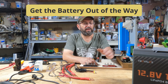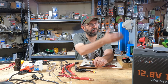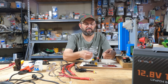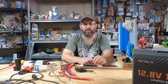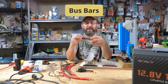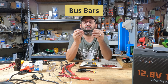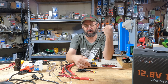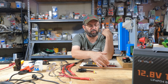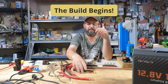I've moved my battery temporarily for two reasons: first, it's physically out of the way so I can reach everything to wire it, and second, you don't want to hook your battery up first because if you make a mistake, you can short something out. Now, one thing I didn't talk about yet is bus bars. This is a 100-amp bus bar — that matches our system and we're going to use two of them. The black one is for the negative and the red one is for the positive. Now let's start wiring up.